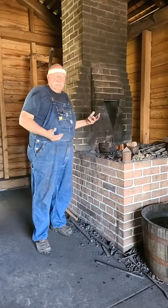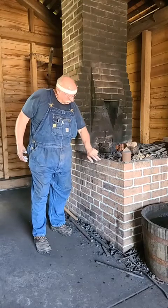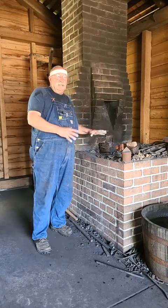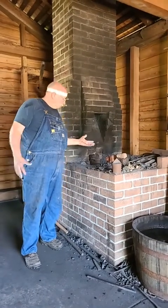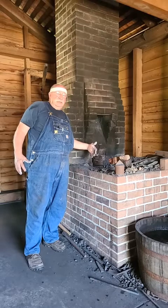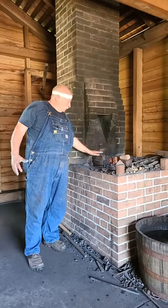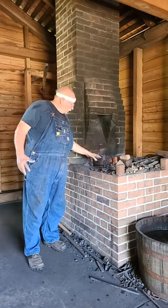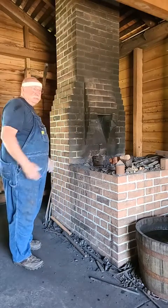So that can all be changed. What we've done is filled it up and leveled it off to this level, and we took some loose bricks and made a table right here. So it just looks like a solid laid-up brick table, but it's not — it's laid up on the outside only; the inside is just filled with rubble. We can adjust the fire pot any way we want by moving the rubble and the brick. We can make a longer trench if we need to, a wider one, or a really small one. But it constantly has to be cleaned out because ashes fall down and start interfering with the good operation of the forge, so we do that every day that we use the forge.